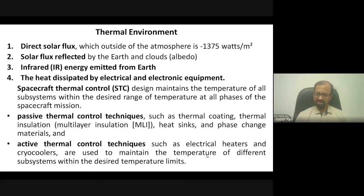We also have active thermal control for devices that must be maintained at a specific temperature. For example, if your camera operates in the IR range to measure temperature, the detector device itself must be maintained at a particular temperature. If not, its own temperature adds to the reading, causing error. So we have both heaters and coolers in such equipment to maintain temperatures within even one degree of the specification.